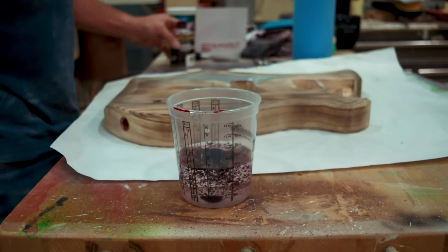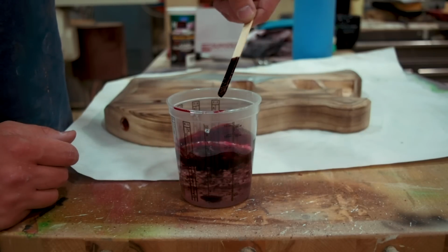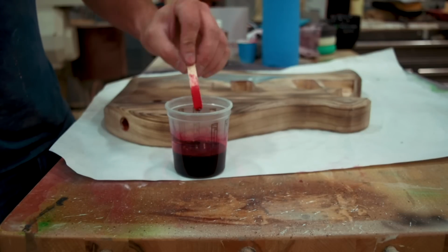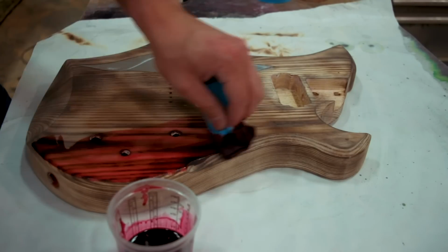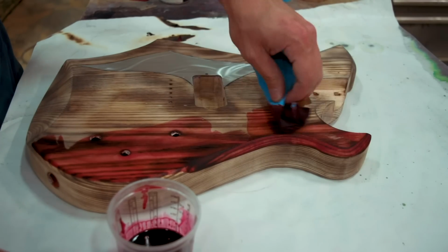Ooh, I talked too long, but look, that's what happens when you try and mix. I did this just for you guys to see, when you try and mix that urethane in water. And here we go, putting it into a solvent. So what I'm doing is a dye finish, basically, but not really, because that candy tint is a concentrate. It's not a dye. It's not meant to be used like this. It's meant to go in a finish.